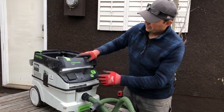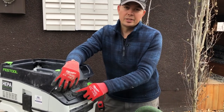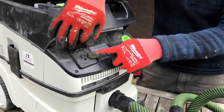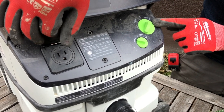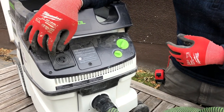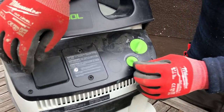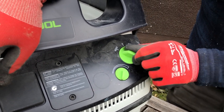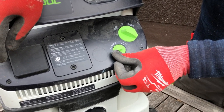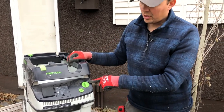Now, the operation of these vacuums — you plug your main tool in here. Let's say you're cutting with a skill saw, like the Makita track saw we just did a review on cutting hardy panel — you plug your saw into this and set it to auto. When you turn on your tool, it'll turn on the vacuum, and when you stop cutting, the vacuum will still suck for a second or two to catch any last debris. There's also a knob for the amount of suction — it's essentially variable speed. You can operate it manually or on auto for your plug.